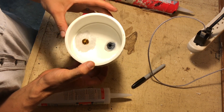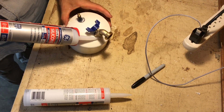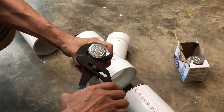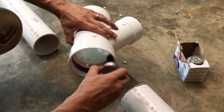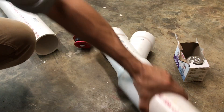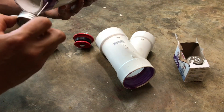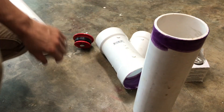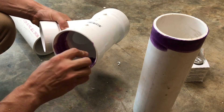Once it's dry and hardened pretty good, you can start gluing your PVC components together. I use standard PVC glue and primer. First thing you want to do is prime all of your joints — the primer acts as a cleaner, ridding the surface of any oils that might prevent good adhesion. The primer also acts as a mild abrasive and etches the surface of the PVC just a bit, so you get a good adhesion with your PVC glue. Cover every square inch of the overlap area with primer.